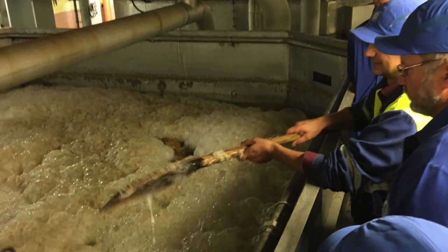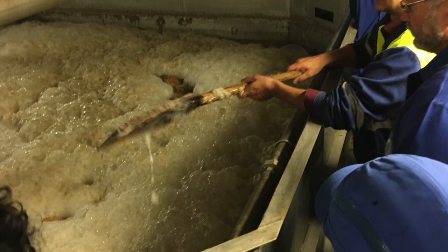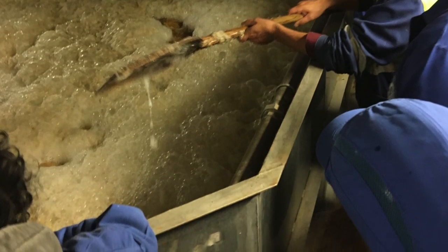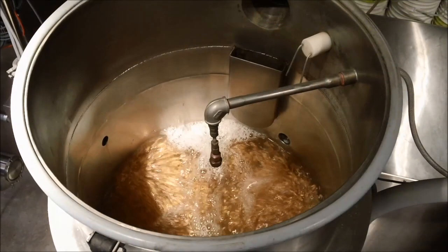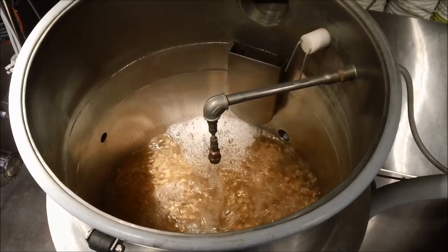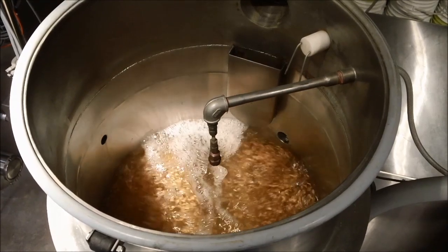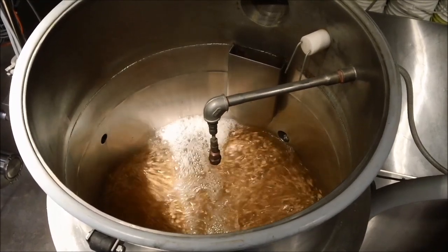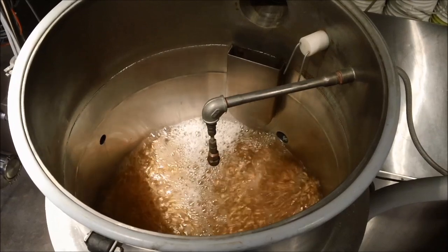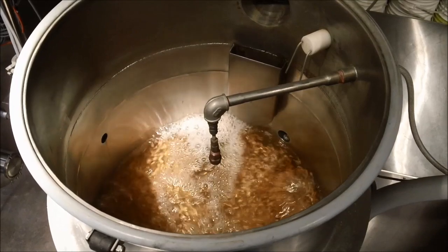Adequate supply of water and oxygen, as well as the removal of CO2, is critical for good water uptake and even moisture distribution throughout the barley kernel to achieve homogeneous malt modification. It is therefore important to provide adequate dissolved oxygen supply during wet cycles by bubbling compressed air through steep water, and to remove CO2 from the steep tank during air rest periods. A lack of oxygen at any stage will stop the growth and enzyme production.